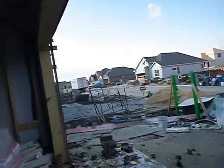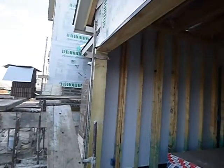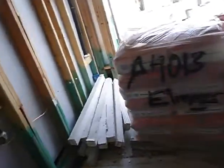As far as we've gotten along here, because we're already putting up masonry, I'm not seeing lintels. It's a metal bar, not seeing lintels. So we're going to be looking for lintels when we show up. For the final inspection, we're going to need to see some lintels. And along here, anchor bolts and anchor bolts.